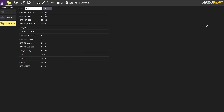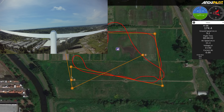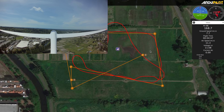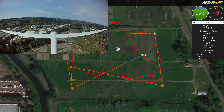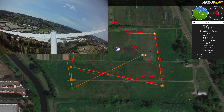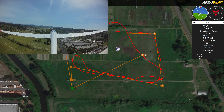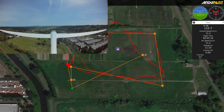When it reaches that soar altitude cutoff it cuts the motor and just glides to the next waypoint, and it'll glide from waypoint to waypoint. Then when it finds a thermal — when it starts to rise up as it's gliding — it'll switch from auto to loiter mode, which makes it circle, and then the soaring algorithms have it track that thermal and the plane will move with it. At least that's my rough understanding of the system.